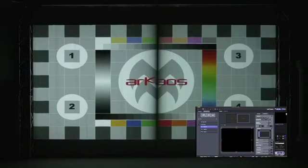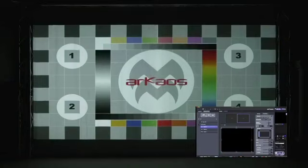If you notice, the right projector's center, the left one's center as well. But that's, again, all the way decreased, the center value. So you'll see the separation there. What we're going to do now is increase this to where we can get it to blend together and just act as one. If you go too high of a value, you'll notice it's going to be overly exposed or overly bright in the center there. So again, we're just going to look for that sweet spot. And again, I don't have the best eyesight, but to me, that looks good.